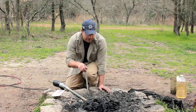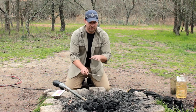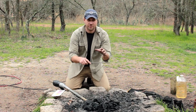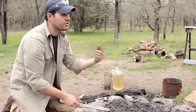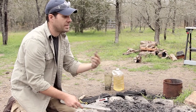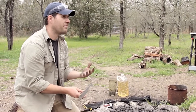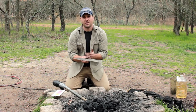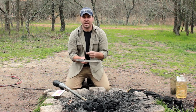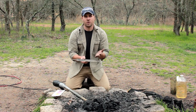You can also do this with a campfire by building a fire over the top of a piece of steel, or sticking the steel in and slowly building the fire up. Then stoke the fire up, get it hot, and let it go out. It's a little less exact because you don't really know how hot the fire is getting. If you under-heat the steel, it's not the end of the world — you'll end up with softened steel, but it just might not be as soft as if it were completely annealed, so it might be more difficult to work with.